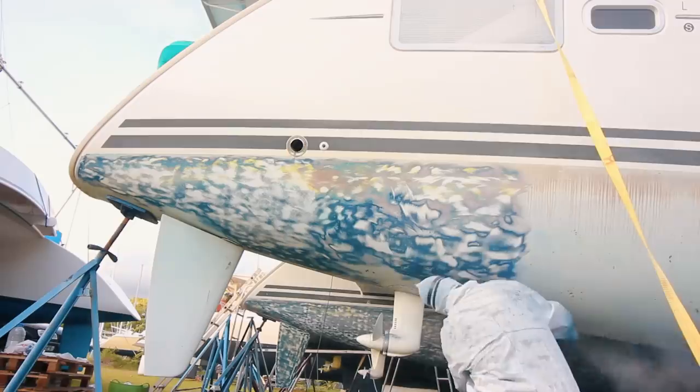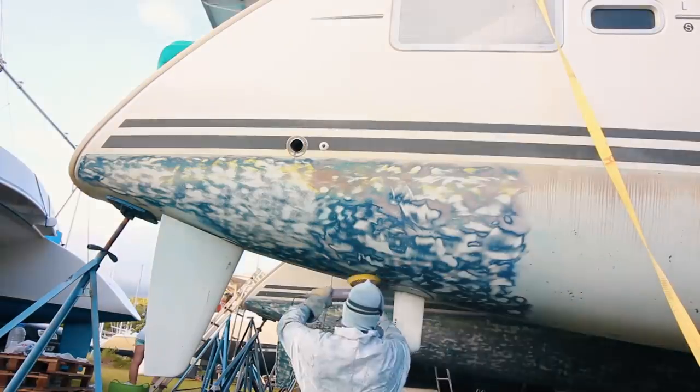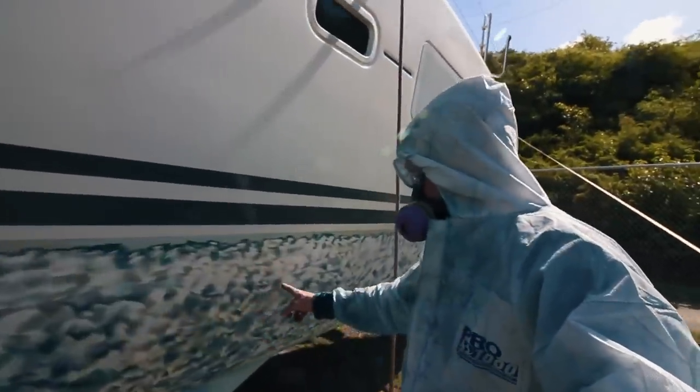Let's get into this boat tour. When we bought it, the boat had 10 years of bottom paint on it. We scraped and ground it all off, then put on hard paint, which is kind of unusual. In hindsight I probably would have gone with copper coat, but we've been out here so long that the hard paint doesn't come off as much as ablative, and that way we can scrub.